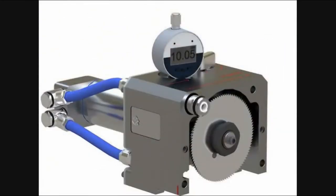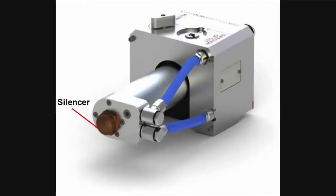Before connecting the cutter module, make sure the blade is secured properly as discussed earlier. Lubricate the O-ring with silicone gel and inspect it for damage. Check to see if the small filter is fitted inside the air transfer fitting. The silencer located on the rear of the unit should be clean and free of debris. If it is dirty or blocked, this will restrict the air exhaust and reduce motor performance.